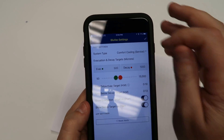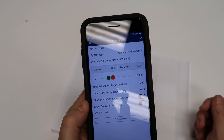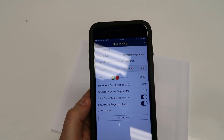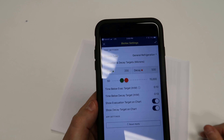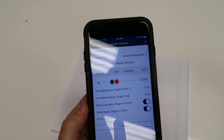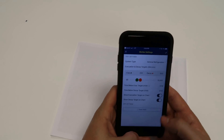It's a really neat app you can configure for different applications. For ultra-low-temp refrigeration it has a very low evacuation and decay target. For general refrigeration the decay target is 500 and evacuation target is 200. The app does the math on the decay rate and tells you as soon as you hit the point where it proves it won't exceed the decay target — you don't necessarily have to go the entire 13 minutes. All in all, it's a great app, and you can see how quickly you can pull a great vacuum and do an effective decay test with the proper equipment. Thanks for watching — we'll see you next time on HVAC School.